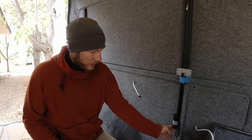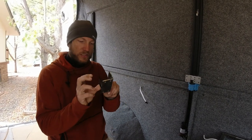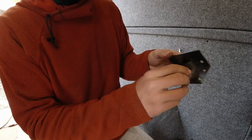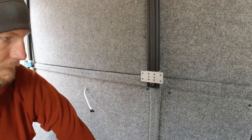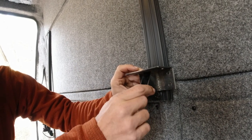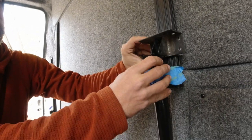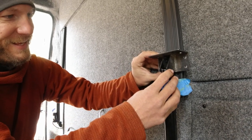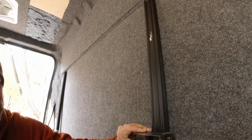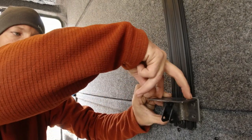The next thing we needed — they come with these little brackets, but they did not come with this L bracket, so these still look a little sloppy. We're not done with them yet, but basically we bought some steel L channel, drilled some holes where it'll line up over on this guy, and then we welded the cheap bracket — we ground them down and welded them on. The paint on it was nasty and it stunk, but we got them welded on. This will go in here, it'll be pinned, and then as it lifts this will go up and down. We bought 12-inch lifts this time because we don't need it to go nine feet like our current one does. And then the bed frame 8020 will mount directly to the top of this.